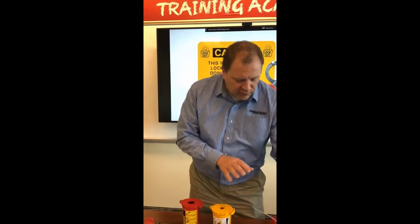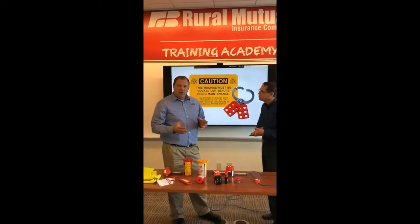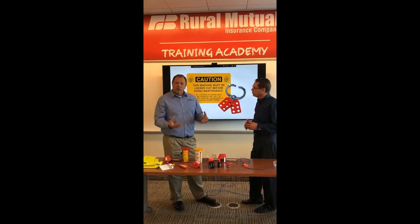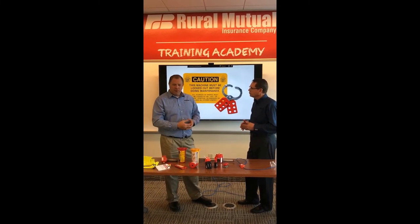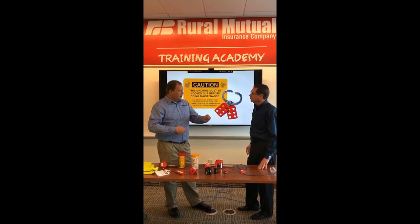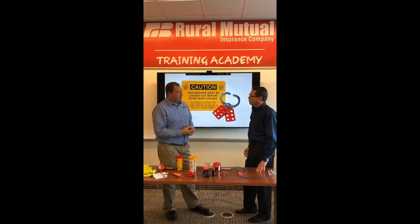So these are some real simple ways that we commonly see used to protect employees. The most critical part is making sure not only that it's correctly applied, but also the next part, which is testing it. Once we've applied it, we want to go through the same procedure that we would normally use to start up that piece of equipment with the protective devices in place, to make sure they won't fail. Whether that's flipping a knife switch or flipping a wall switch, we want to make sure that we physically can't do that to restart that piece of equipment.